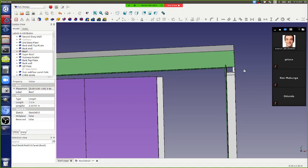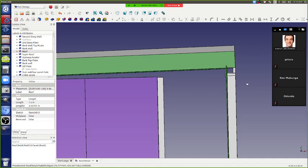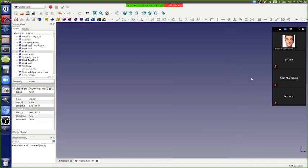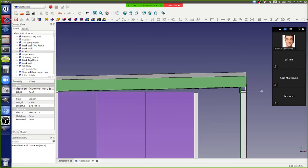Racking meaning like it bends from a square to a parallelogram, like under loads it kind of racks. The thing that this misleads on is the fact that this does not show the sheathing, which is responsible for all the racking forces. So yeah, this looks kind of scary from this view, but it's also misleading because it's not showing the truth. When you see the box of the house covered, you won't see what's inside, and you'll be quite comfortable because you see the house is just a solid house. That's how it's going to look from the outside.